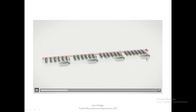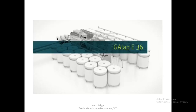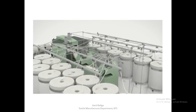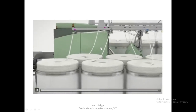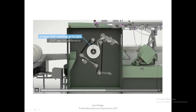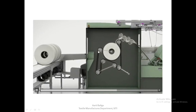As you can see, one omega lap would feed around 6 combers. You can see the omega lap E36 machine. The slivers enter the two drafting systems, and the web is coming out on the table. This is the internal mechanism showing how the lap is formed. Once the lap is formed, it is automatically ejected on the table.